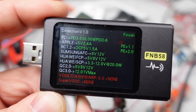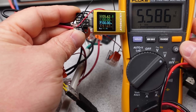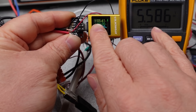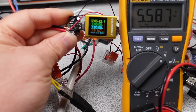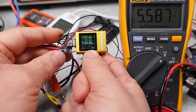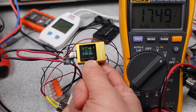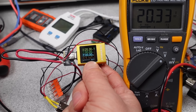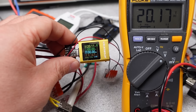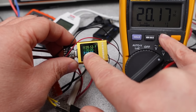These meters are complicated but manage to accomplish quite an impressive amount of work inside a tiny package. I'm not going to make a lecture on metrology, but basically the equipment I use is at an order of magnitude or two orders of magnitude better than the equipment I am verifying. A sample size of one is being used, and the accuracy is multiplied by two, assuming a standard distribution for a 95% confidence level. Hundreds of samples over several years is more likely to provide a picture of performance. No least significant figures were added in measurements.